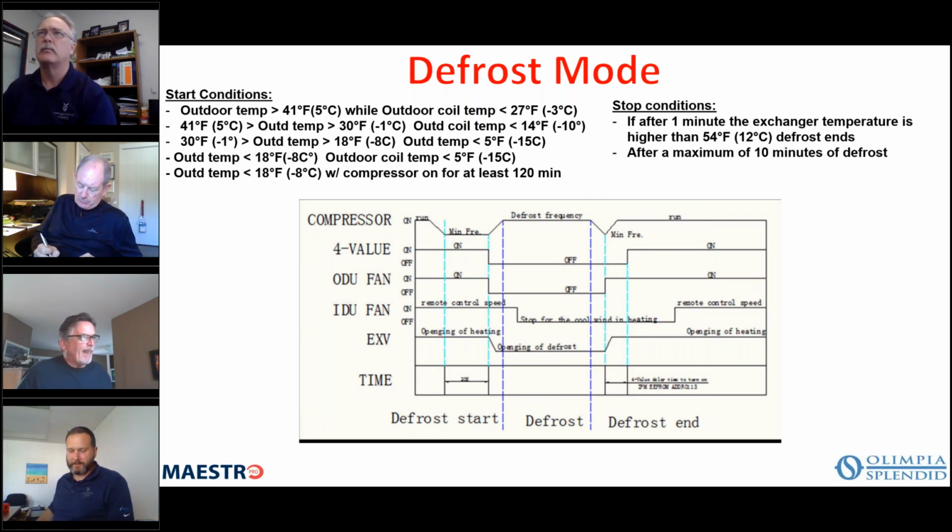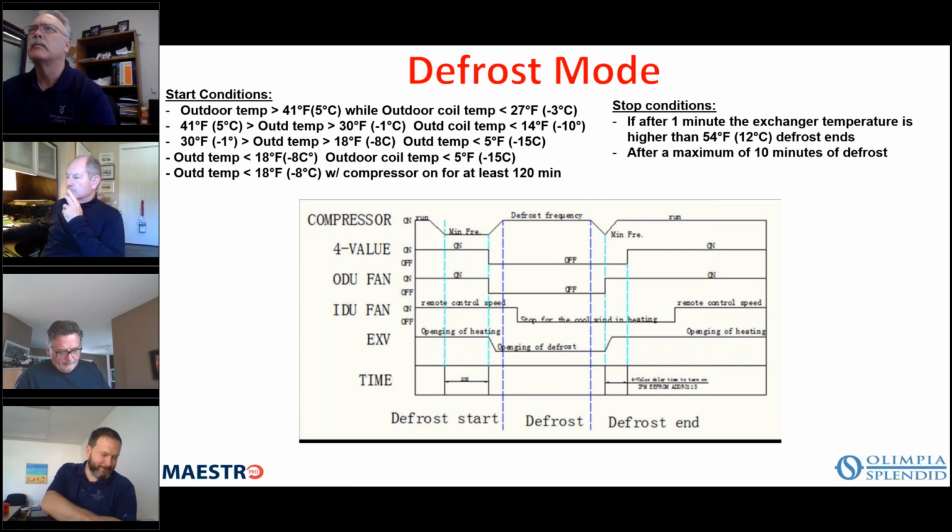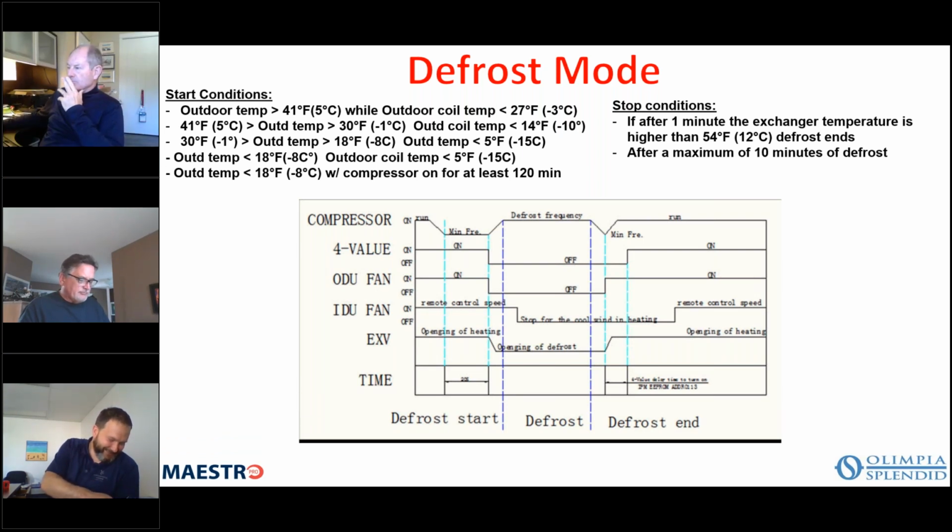The flap opens, and the internal and external fans are activated at maximum speed. The four-way valve, the condenser drain pump, and the electronic TXV are all activated. The compressor starts, rises to 25 hertz and then stops. The flap closes, and the unit stops. Then the indoor and outdoor fans will be stopped as well. You can interrupt the test mode at any time by pressing the on-off button.